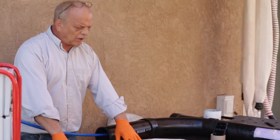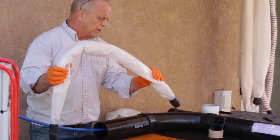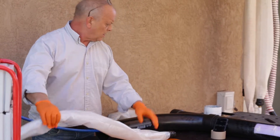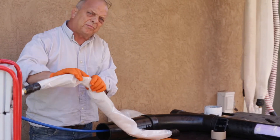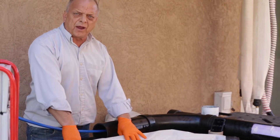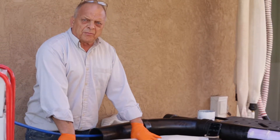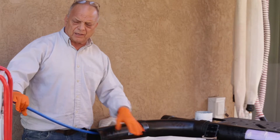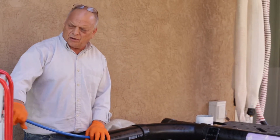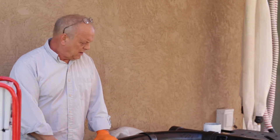You can operate in full sunshine, even in California. Once you get to the job site, you can insert it into the clean out or the pit. Withdrawing the black plastic sleeve, push it into the pipe all the way down to where your repair is. Once you're in place, inflate your packer device through the air push rod and power hose. This is 90 feet on the LSR Pro. We have a mini that's 45 feet and a regular that's 90 feet control unit.